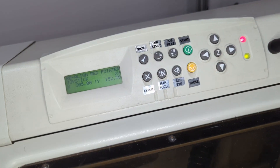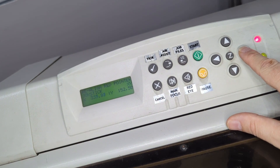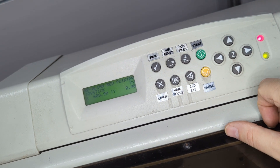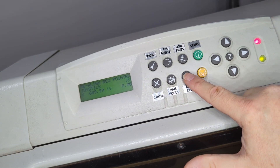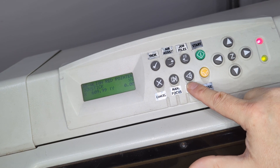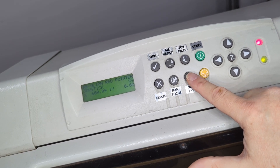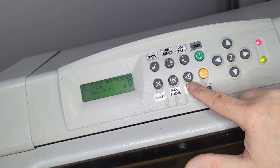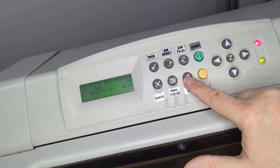Once it's in the middle of the bed, you can use the normal adjustment buttons to move the carriage to where you want it — in this case, top right, closest to the first mirror. From there, you push the red eye button. You'll hear the laser wind up with a high pitch noise, and then it'll fire. The first time you fire it may take a little longer. Then basically you push the button, hear the click to turn off the red eye laser, which fires the actual CO2 laser. The longer you hold it down, the more it will burn — so keep the pulse as short as possible.